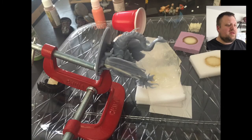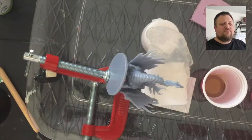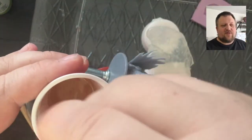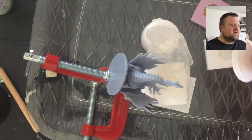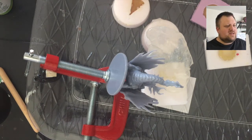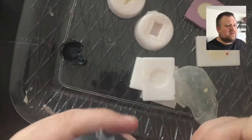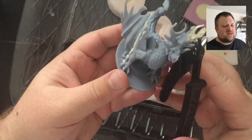Then all we have to do is pour the plastic into that space. It's not a perfect method — you will end up with one side being flat — but actually this model already has flat planes as the wings and horns, so the flat part of the horn isn't going to bother us. Though for something like a really rounded unicorn horn or Viking helmet horn, this method would not work as well and you'd want to do a two-part mold instead of the singular press pour we did here. We'll get it out of the mold and clean off the little excess plastic.